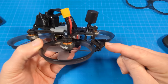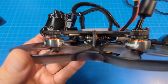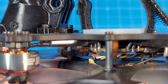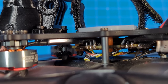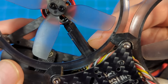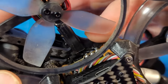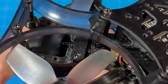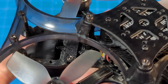We have 3D prints for our antenna — our T-style antenna, as well as our O3 antenna, and obviously the canopy. They've taken the O3 camera and wrapped it around that metal standoff so you have the camera angle you need but it's not going to get in the prop line — that was something I was looking for after the last review. We also have these plastic sleeves on the motor wires; you might want to wrap some electrical tape around there if it seems to be coming loose, though it's close enough to the motor mount that I don't think it would. And there's a little 3D print that holds our O3 camera cable — they've really thought about just about every little safety precaution on this thing.